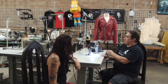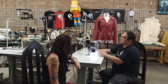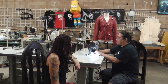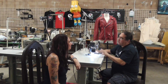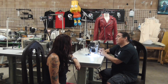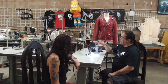Another really cool feature is they've adapted these swing-down edge guides. All these sewing machines have different fixture points, so the generic flip-down guide wouldn't just line right up — you have to make an adapter to make it fit. I had a small part in developing the bracket for the 18, the 20, the 26, and the Class 4. Now I'm going to talk about what I personally did to this swing-down edge guide, which is not available through the normal stream — so if you do this to your edge guide, the Leather Machine Company probably won't back up your warranty. Every machine I have that has an edge guide gets a magnet on top and a little wrench that lives on it.